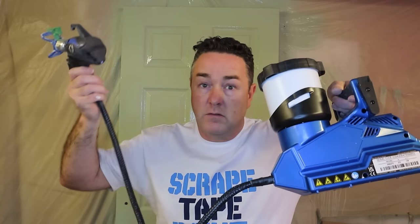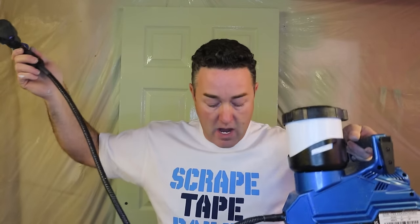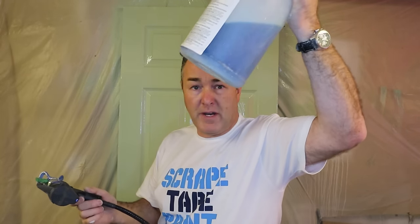So on that note, I'm not going to show you how to wash this out because it'll be another video, but I will say this is very easy to wash out because all I'm going to do is put water into that pot, flush it through as if I was spraying until the spray starts coming clear. Once it's clear, I know it's got no paint left in the hose. And then what you do, and I'll show you on the next video, put a bit of pump armor through it. Look after your spray equipment, it'll look after you.